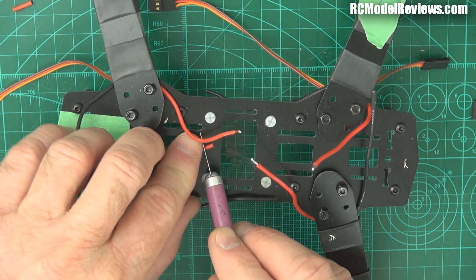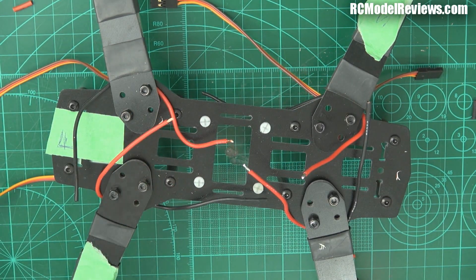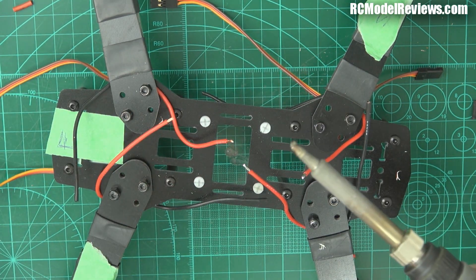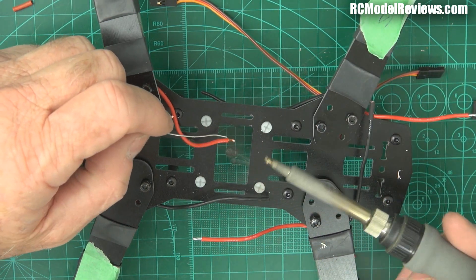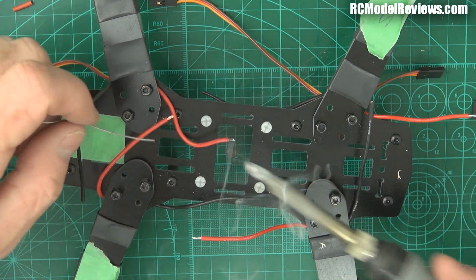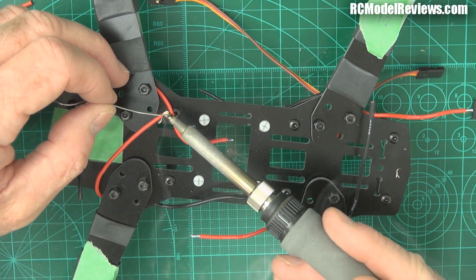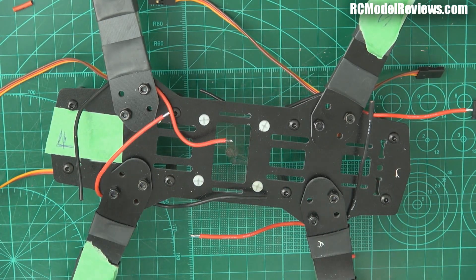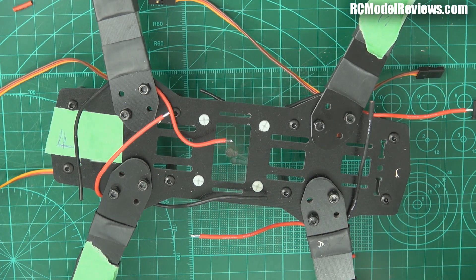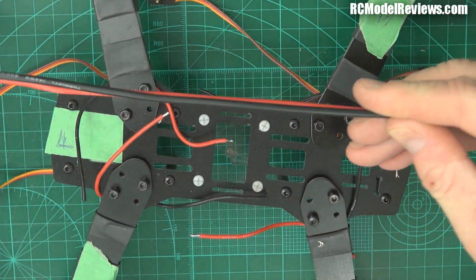You might not be as quick as this - I've done this lots of times and I am a professional. Remember, no lead-free solder - that'll ruin you. You notice you don't dwell, you get the solder on there and you get out, nice and quick. Now I've got all my red wires tinned up, and of course we're going to need some wires to connect up our XT60 connector as well. What I generally do is join my wires up to the loom - here's my 14 gauge wire I'm going to be using.